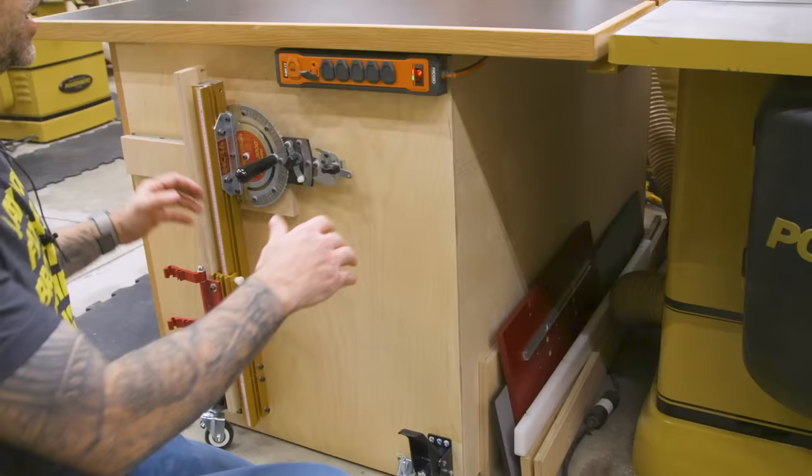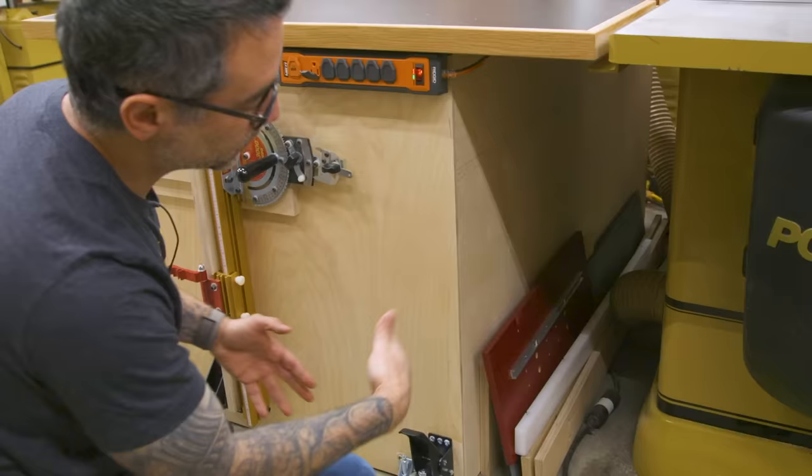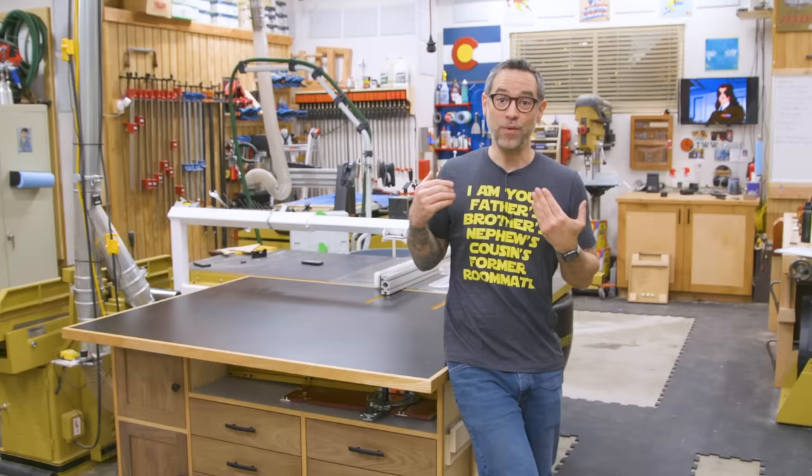Because I want to keep this nice and level with the table saw, I've got adjustable feet. I kept the cabinet at about 30 inches deep — any more than that is just way too big. That also gives me a nice overhang that works out well for meeting up with the table saw and giving me room for extra storage for long things, sacrificial fences, and my dust collection. We've got a full plan for this at thewoodwhisperer.com, but you could probably figure it out just by watching it go together.